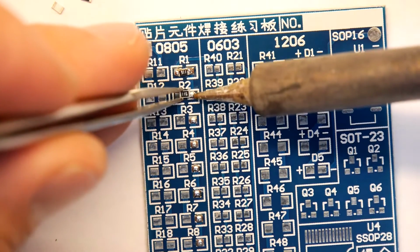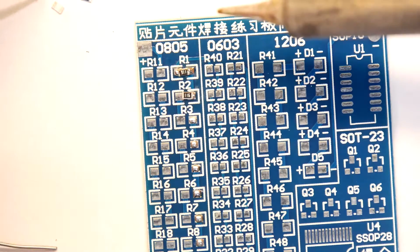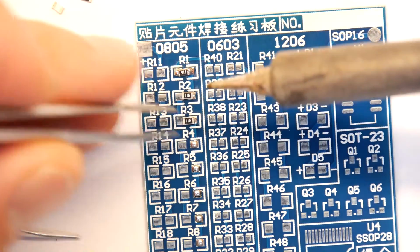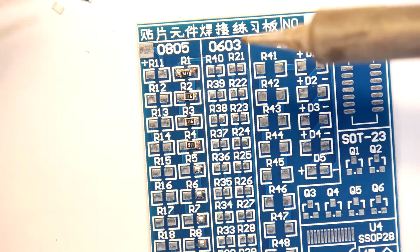So get yourself a little process, you know, how you're doing it. If it's a circuit that you're building yourself though, of course, you're going to be doing step-by-step testing of each section of your circuit. So you're going to test the power regulation, test the clock, test the CPU. But for this, we don't even have to think, we're just chucking these down.